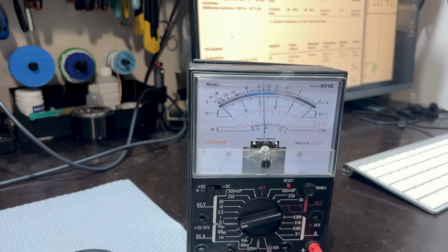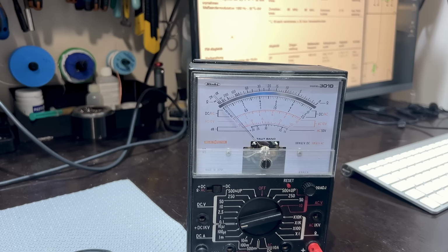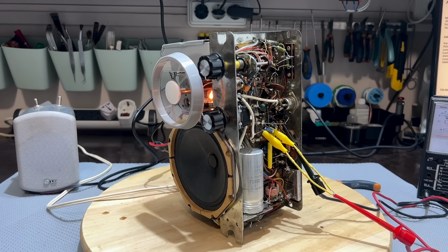It's going worse. Now let's see that. If I go that way, it goes to the top and then it stops. I go this way, now I've got to turn the polarity around and it's climbing on the other side. So I found my spot, and the spot that I want is absolute zero over there. My discriminator is now perfectly balanced. So that's done. Now that's not too hard, is it?